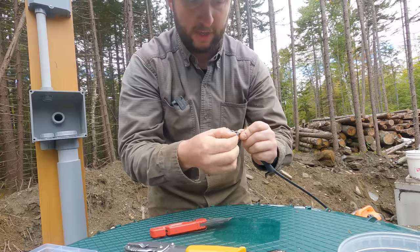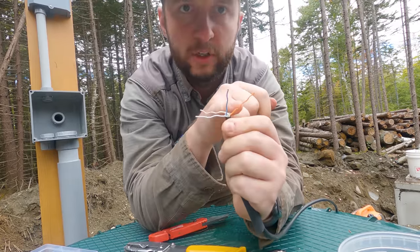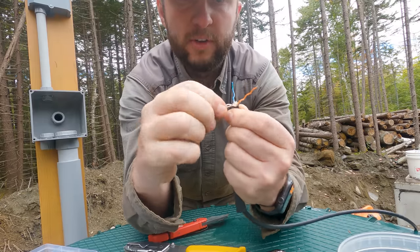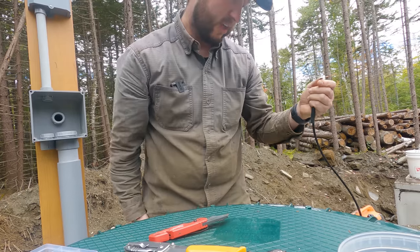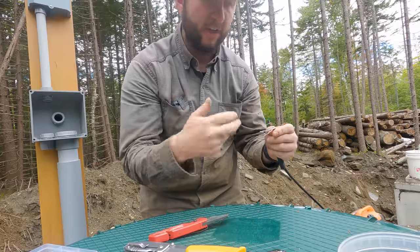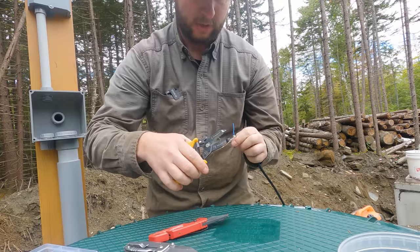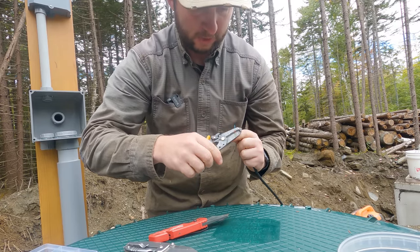So essentially you can see there now, we're going to have 5 volts on the orange wire, data on the blue wire, and the two stripe wires here will be tied to ground. So I'm going to strip these back. We can then tie those onto the assembly that I just made, using the color coding on there to map to this one. I'm using my nice clean shirt to wipe this gel filled stuff off. So I'm now going to strip off a fairly generous amount on here.